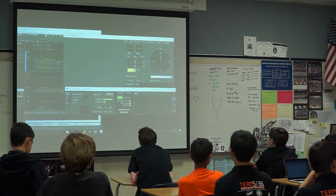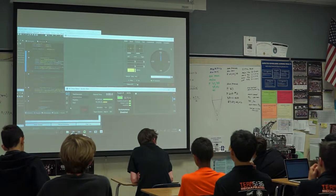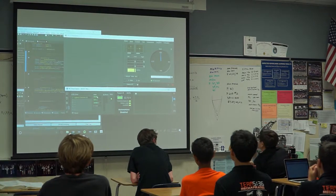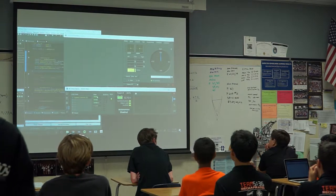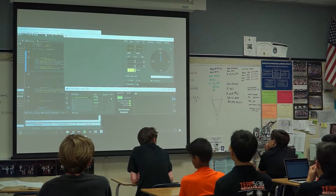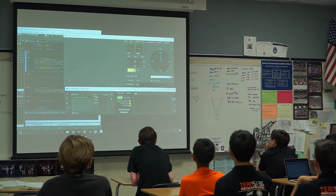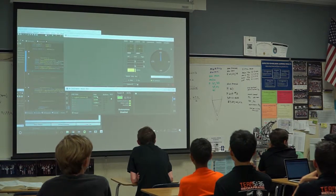So yeah, this gives you information. It also is how you configure stuff. And it might also tell you what kind of joystick you have. So it'll tell you which things are assigned to which places, so you know that you can drive by moving axis 1 and turn by moving axis 0. So let's actually put the code on the robot.